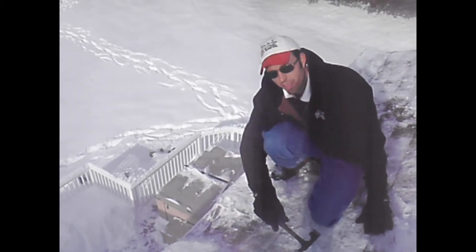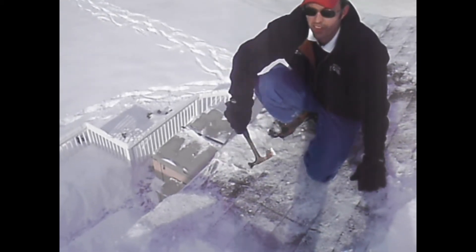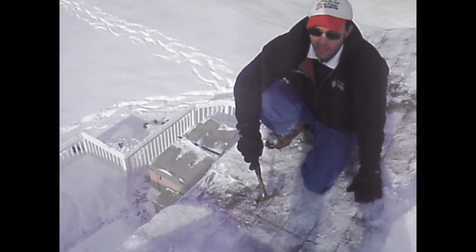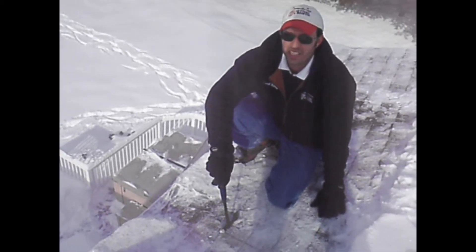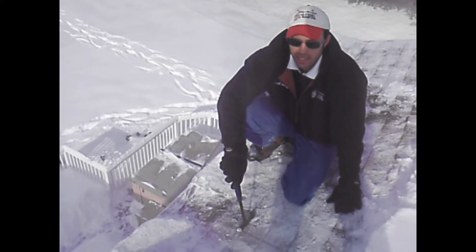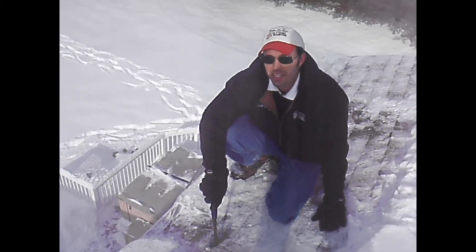What I've done here is I've created a path for the water to run out over the gutter, not forming a dam. The client is going to probably have icicles — that's an unavoidable force of nature from the thawing and refreezing effect of the warm roof water hitting the cold air. That's it for now, see you next time.